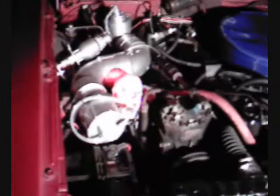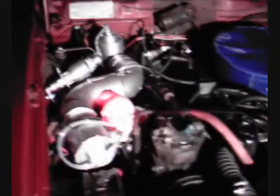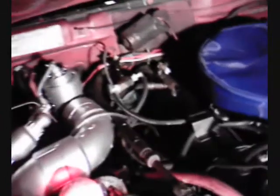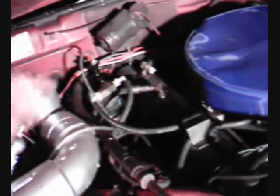The reason I changed this hose is because of the folds in it. It was folding and shutting off the gas flow. So that was one little kink I had to get past. And then my bubbler failed. The original bubbler I had vibrated and had a hole in it. So I added a metal bracket, and I put in a medical bubbler. I put a little metal bracket in this.